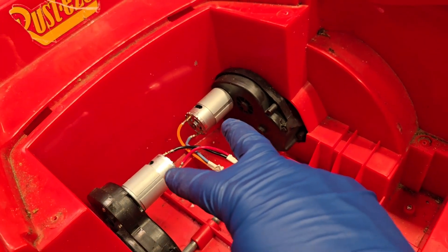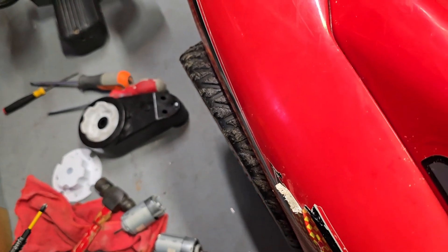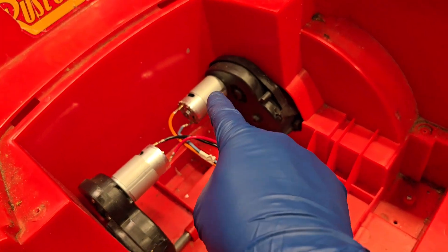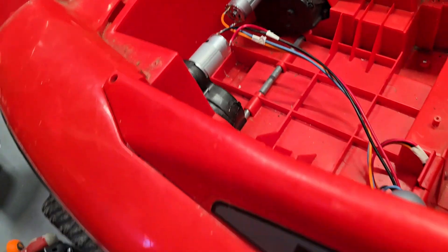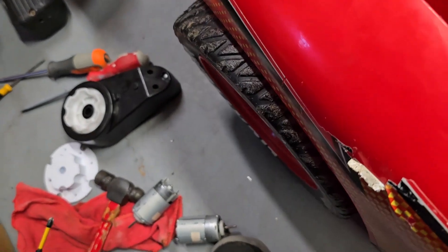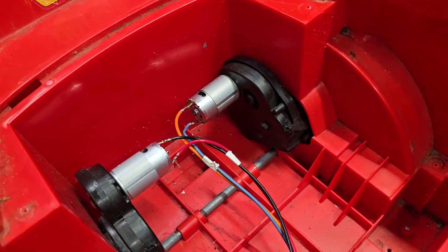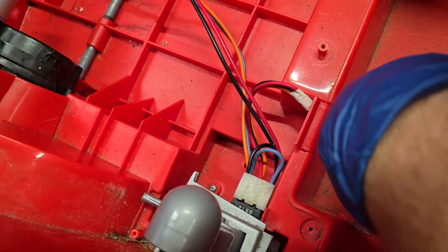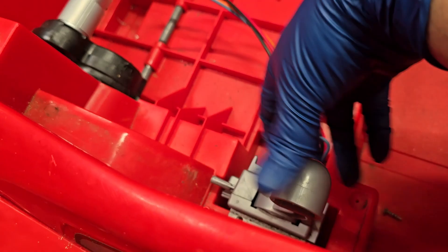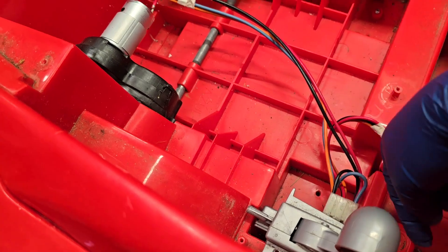That's why we go to 24 volt motors — these have better windings and are going to handle 20 volt better. They're not going to run as fast obviously, since doubling the voltage on a 12 volt motor was really running its heart out. I put it back on the old transmissions, reassembled it, the wires are soldered up, and I run it to check for polarity. Both motors are technically running in parallel, and it's all done through the switch down here — there's no real electronic throttle controller, it's really just a dead-nut switch and as soon as you hit it, it hits.